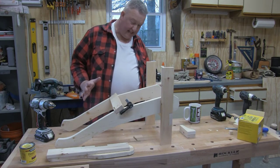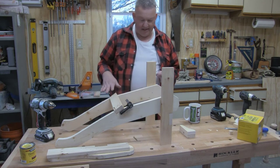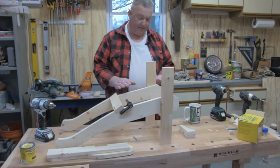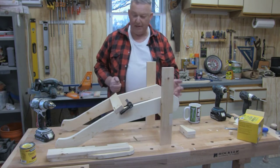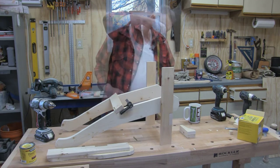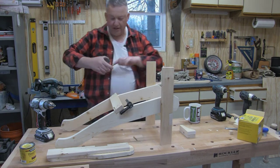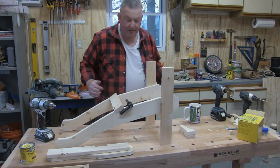I came to an interesting stage in the prototyping — I've kind of got the basic frame together and this doesn't look too bad. I didn't want it sloping too much because young kids will be sitting on this. I think I've got the depth right; by the time I've got boards and slats on here that should shape out nicely. The height seems about right — ten and a half inches — so by the time I add the slats it'll be up at about 11 inches, which should be good.